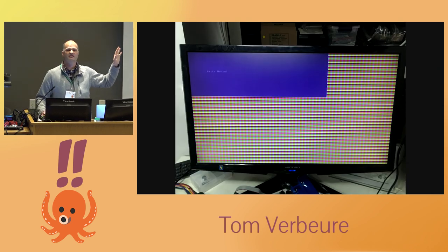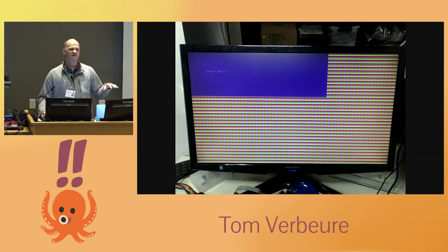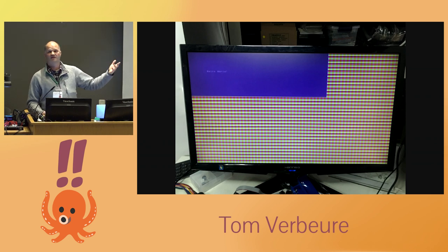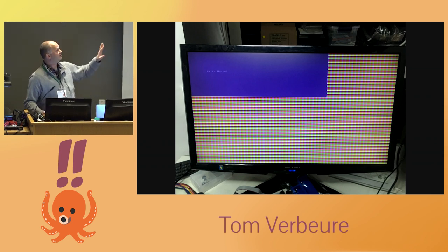These things are actually a dream for FPGA hobbyists because they have all the components and are really cheap. The first step was to reverse-engineer the schematic — you desolder the components and with probes go through about 200 connections, finding how they're all linked to each other. The next step is getting those interfaces up and running.